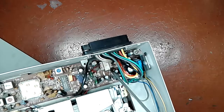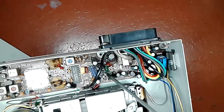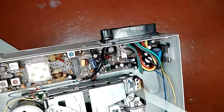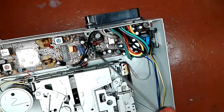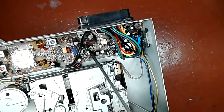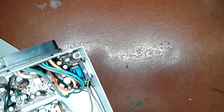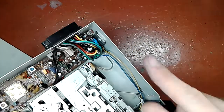In this particular case, I guess it is hooked to the preamplifier, which is made around 2 transistors here or more. They might be shoved all over the place, but the signal from the heads comes to the preamplifier built on transistors. Then the preamplifier pushes that signal into the transformer, and the output of the transformer goes to the power amplifier, which is right there. What's wrong with it? I don't know, it may be actually working alright.